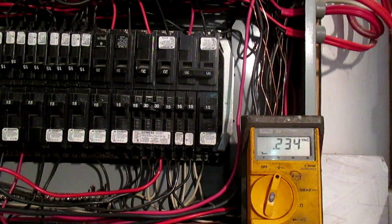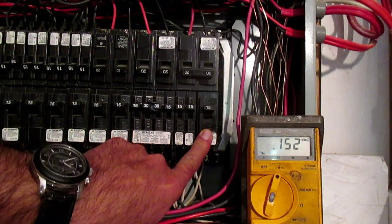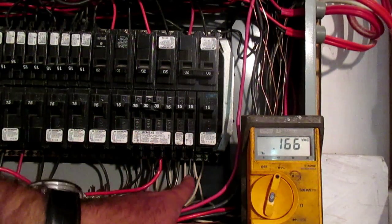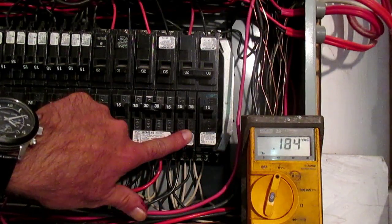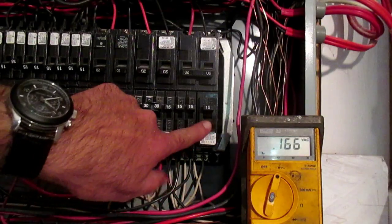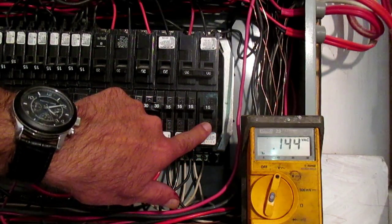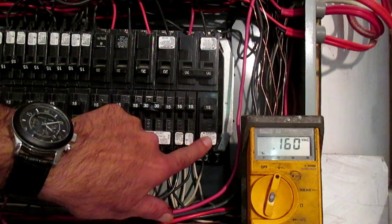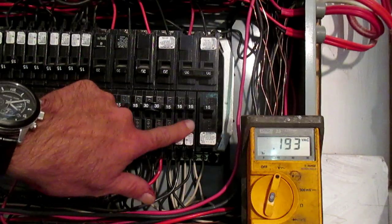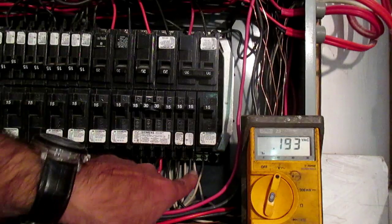This electrical panel has only one spare breaker slot. You can see there's no wire running to it, and the next slot over has two circuits wired to it. Here the full slot is taken by a 15 amp breaker. These are called mini breakers. You can see that there are two of them in one slot position, so you can actually wire out two circuits.